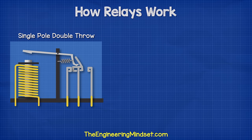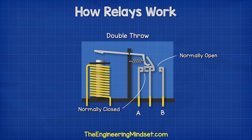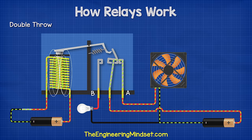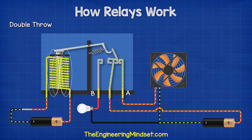When dealing with relays, you'll often hear the term throws. This refers to the number of contacts or connection points. A double throw relay combines a normally open and a normally closed circuit. A double throw relay is also called a changeover relay as it alternates or changes between two secondary circuits. In this example, when the primary circuit is open, the spring on the secondary side pulls the contactor to terminal B, powering the lamp while the fan remains off. When the primary side is energized, the electromagnet pulls the contactor to terminal A and diverts electricity, this time powering the fan and turning the lamp off.